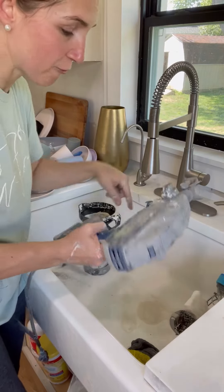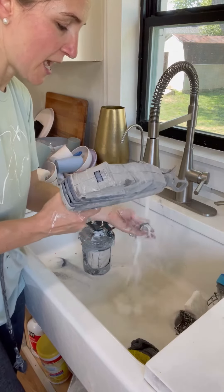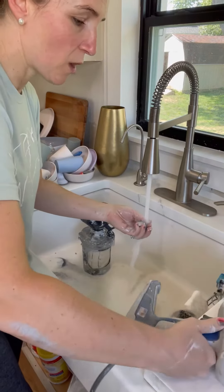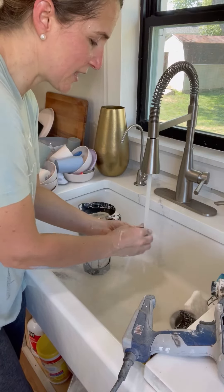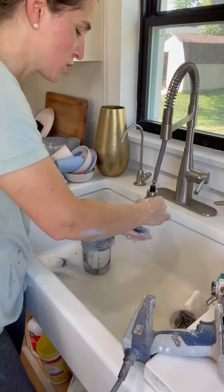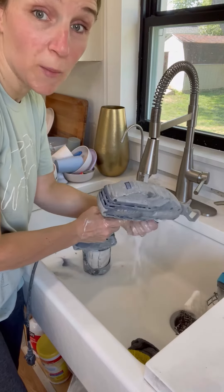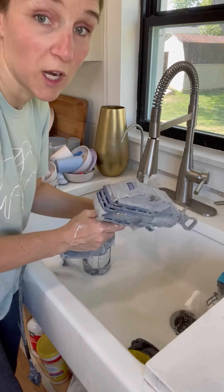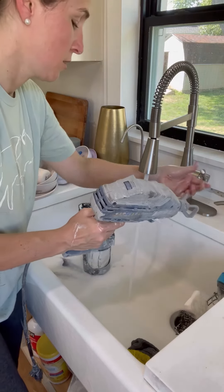First thing I do is I rinse. You always keep your gun mostly upright or else you'll get some paint in it. I take this little guy out, and I usually have a paintbrush or some sort of brush that I can get in there. If you are using a shellac-based primer or an oil-based paint, you're not going to want to use water — it will clog and ruin your sprayer. You're going to want to use acetone.